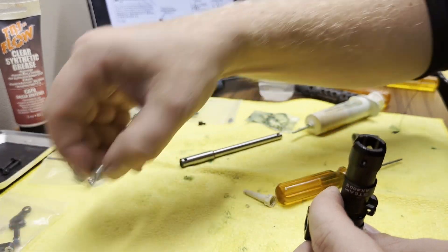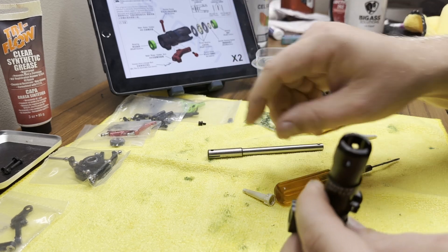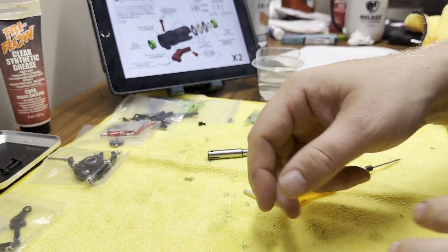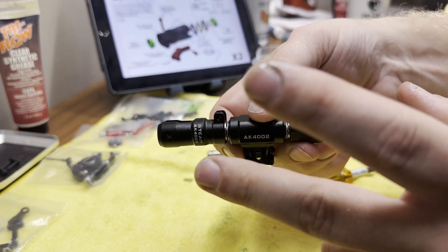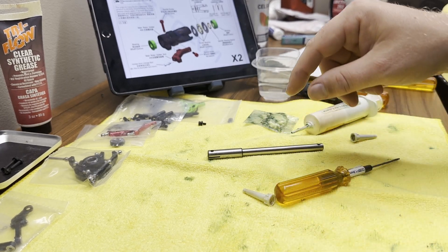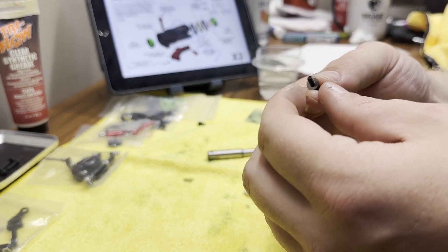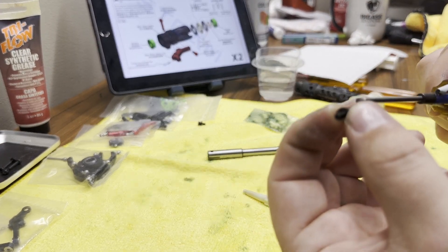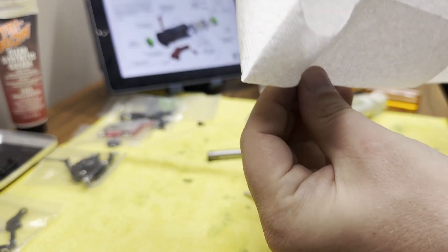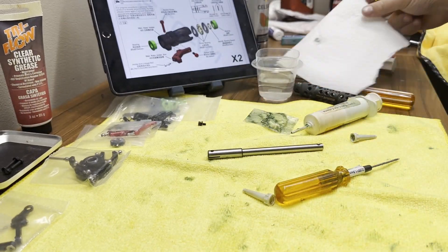Use the main shaft here to push it down — that worked out well. And finally the bearing. So we've got everything in minus the two screws. Next step is to clean out the feathering shaft once again on both sides. Try not to use too much rubbing alcohol and wipe it out of the thrust bearings you just built. Just grab the screw, dunk it in some rubbing alcohol, and wipe it off until it's clean and repeat. There's a thrust bearing that would come apart if I did not do this.